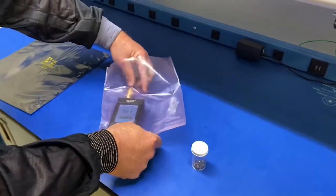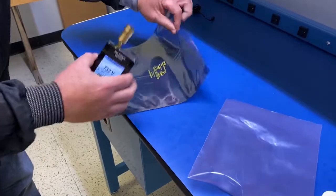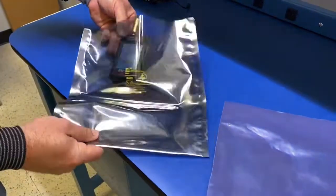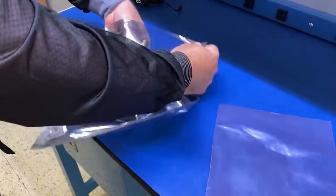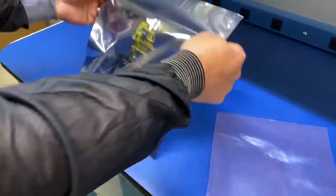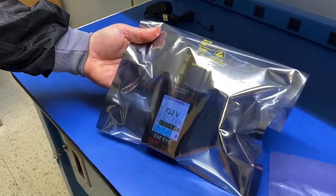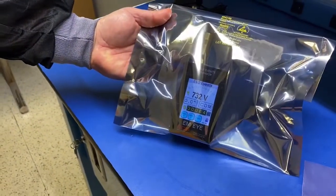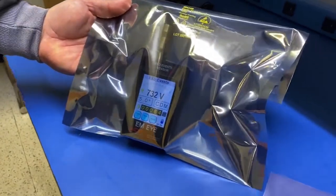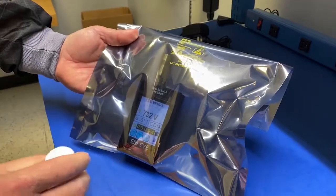So let's try the same thing with a metalized shielding bag. The difference is, this bag has a buried middle layer that protects against the ESD event. So you'll be able to see the screen. Same fold, same application. Shake — zero. 100% shielding. Try it again — nothing. Zero voltage is penetrating through that bag to the EMI sensor.